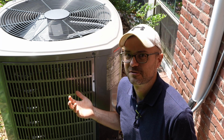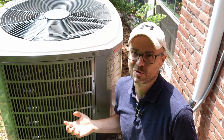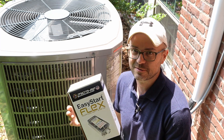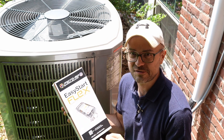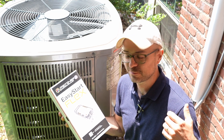And the other thing is, when this starts up, all the lights in the house flicker, also because of all that inrush current. And that's where a soft start kit like this is supposed to help. So instead of all that current rushing in at once, this is supposed to ramp up that current and start up the compressor nice and slowly. And hopefully it'll reduce that noise and reduce the flickering of lights.